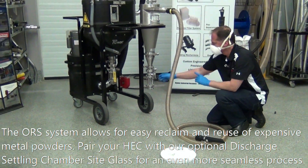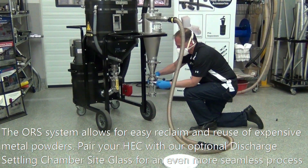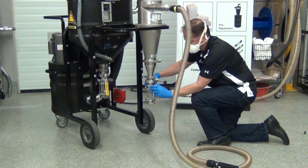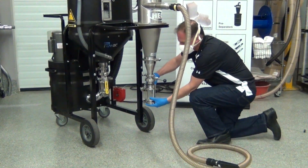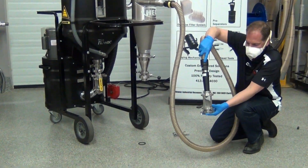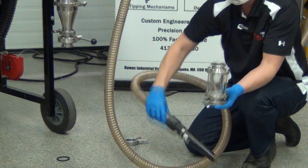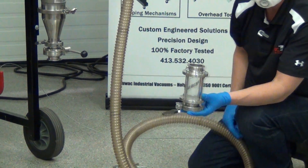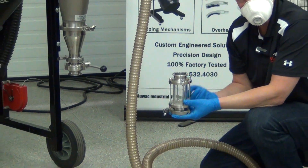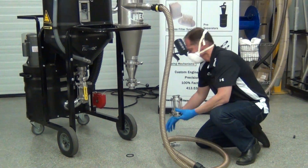So now that when you're done, you'll be able to shut the ball valve and remove the sanitary connection. Remember your container is full here — this indicates that your container is overfilling. You'll be able to easily remove that. With that open, you're going to take the vacuum and suck out the sight glass, so now that is completely empty. Disconnect it from your container, put it back onto our machine with a new container, and then you can open this ball valve up and start vacuuming again.